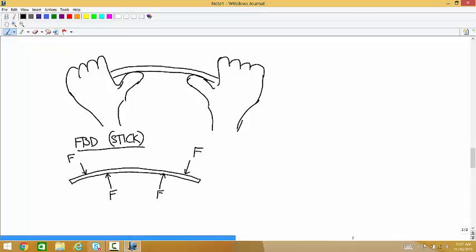And so if you're just assuming that this thing is most likely to break where the external loads are maximum, you would think this break would happen in one of these four spots. But that's not what would happen if you do this. Do it right now with your pencil. The break is going to happen somewhere between the two thumbs. And there's no way to calculate where, but it's not going to happen over by the external loads. It's going to happen in here. The break starts here.